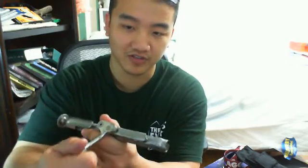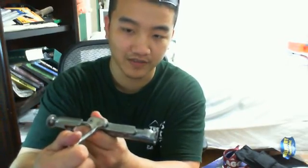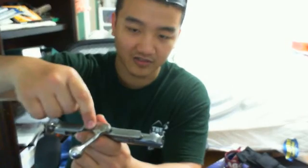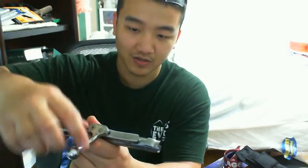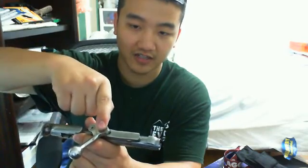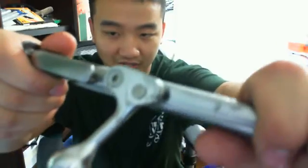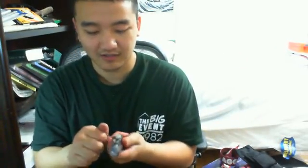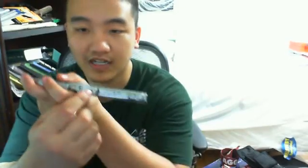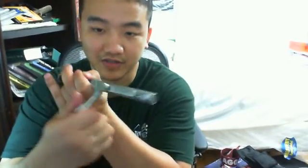I drill out this part for it. So there are 2-point fixtures, so whenever you pull back and forth, there's no point of pivot, because this is the place where most of your torque is gonna be applied. If you put another fixture here, there's almost no way for it to move at all. As you can see, I had 2 places where I had to drill, and I do recommend doing that if you're just a garage person like me, because I'm not gonna pay a gunsmith to do it professionally. I had 2 points of fixture, so it won't move, and my bolt's rock solid.